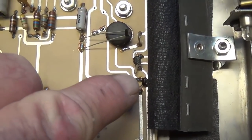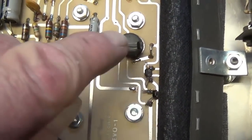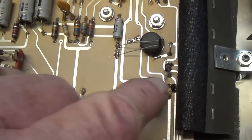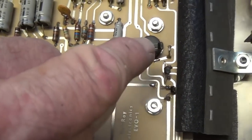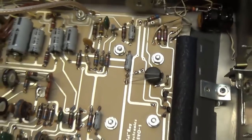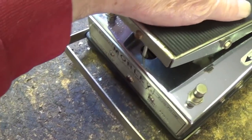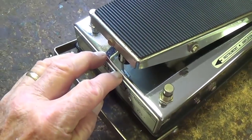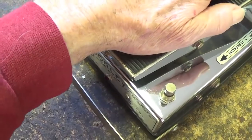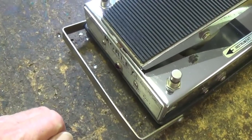So just like the photoresistors in the tremolo circuits in the larger Fender amps, this unit uses photoresistors, but in a strange way, in that it actually has a mechanical blanket that it puts over them in sequence, and apparently that will alter the volume of the boost or of the echo delay effect. In this position, the three little photoresistors are exposed, and you'll get maximum volume. When you push down on the pedal like this, it covers the resistors and shuts the volume down to zero.